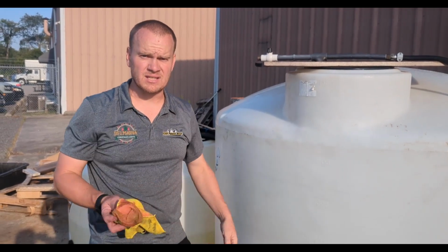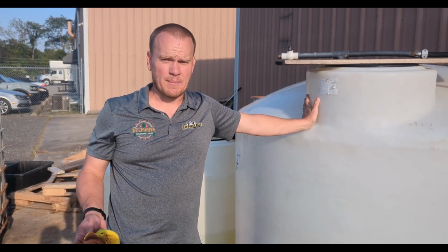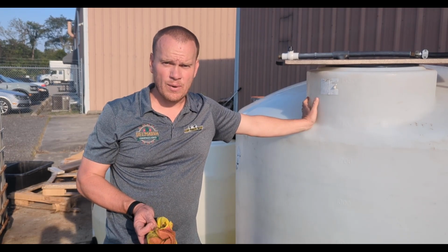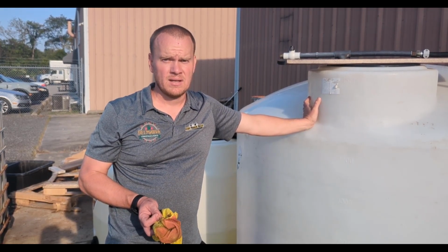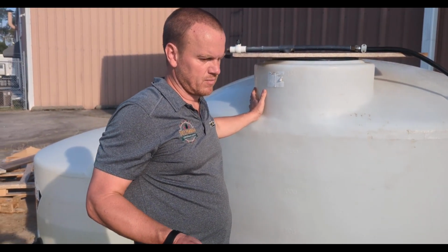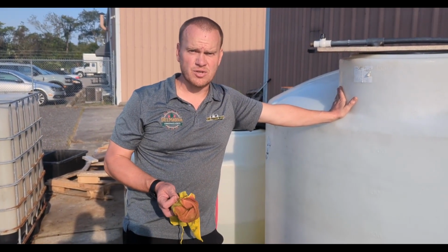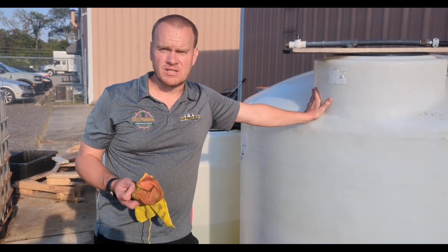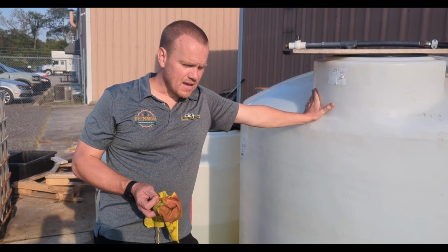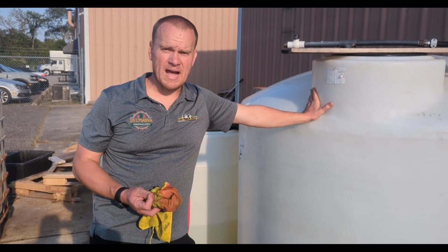If it's a painted surface, if it got spray painted, one, with the client, we're going to set that expectation that there is potential to impact that paint. We've removed it off of highway signs, brick. We removed it off of another company's vehicle that got tagged with some graffiti. For vinyl wrap, each surface is going to react differently. It could be vinyl siding if it's really old, taking off cement and block. Those are all going to impact how it's going to come off.